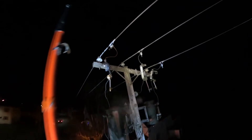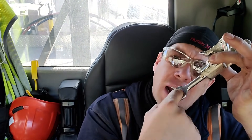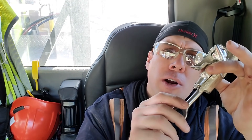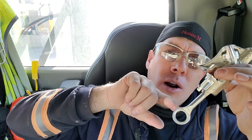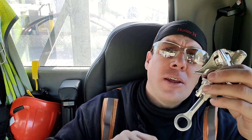Sometimes when you're building the line you might put these on by hand if the line's dead — granted you're leather-gloving new construction, and guys will take a screwdriver, put the screwdriver in there, and really come down on it. If you tighten that up with a screwdriver there's going to be no way that someone will ever get that off again with the grab-all, or you won't have as much leverage on the actual ring when you're loosening it off. So if you are going to use a screwdriver to tighten it up, it only has to be snug. It might be a good idea to practice: see how tight you get it, put a grab-all on it, make sure you can get it off — get used to how tight to actually put these things. There's nothing worse than working on a line in pouring rain, you put your grab-all on that tap clamp, and it's on there too tight and you can't get it off.